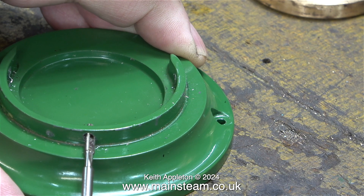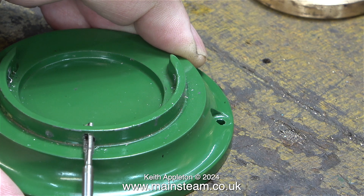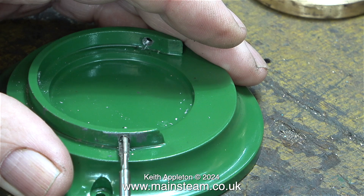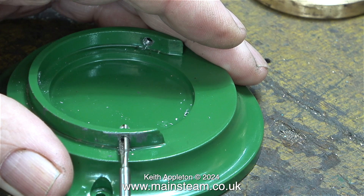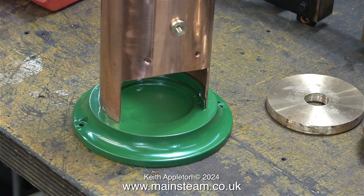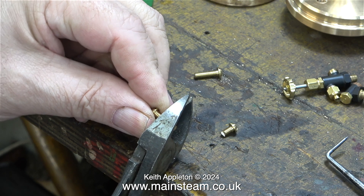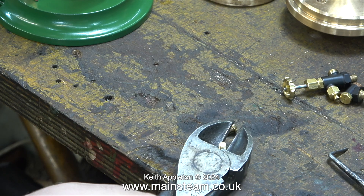Normally the main Burnack Vulcan boiler is mounted to the base using nuts and bolts. I thought it would be a better idea to thread these holes 4BA, because the holes in the base are 1/8 of an inch in diameter, which is tapping size for 4BA. Once I threaded the holes, the next job was to make some short bolts by cutting down some longer ones.